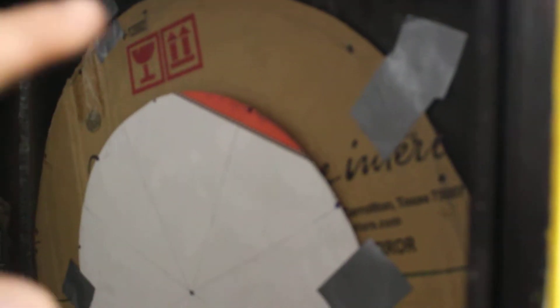The dots are all the same distance from each other. These dots are at the same distance from the ones in the center, and the center dots are that same distance around the perimeter, with a dot in the center. What those dots are for is where a filament is going to be placed. When I get this filament system installed, a filament is going to be placed there, and that's what's going to hold the aluminum that's to be evaporated. I have a program that told me where to place all these filaments to get the maximum aluminum evaporation, so I can accommodate any size mirror up to about 22 inches or so.